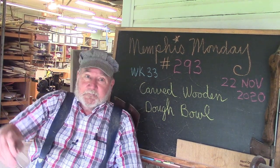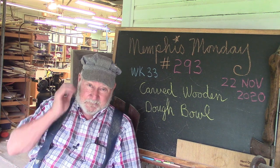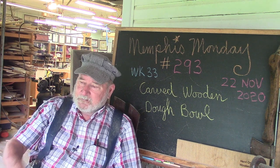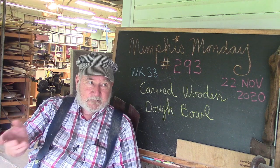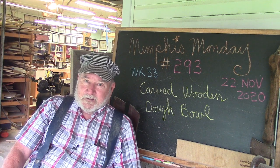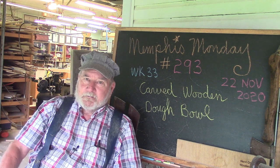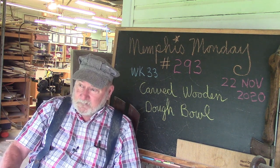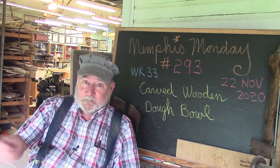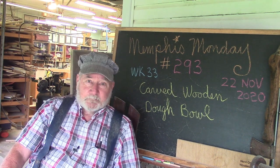Well, that does it for Memphis Monday 293, our carved wooden dough bowls. I think we went over just about everything that you need to know to make them. I didn't spend a lot of time showing the carving because, boy, that gets kind of boring. Carve, and then you carve some more, and then you carve some more. But if you have an angle grinder, if you follow those tips about making the rings, stacking the rings on top of one another, gluing them together good, and then with an angle grinder, you just knock the tops off the little square parts, smooth it out with a disc sander, and it makes real nice little carved bowls.